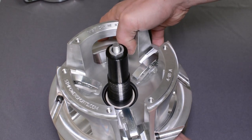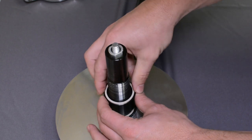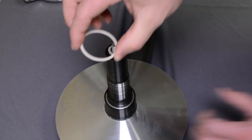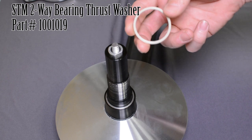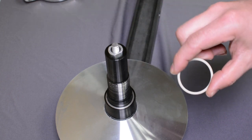You can pull the sheave off. If you need to replace the thrust washers, those are part number 1001019, sold each. There is also the bearing — two thrust washers in total, one on top of the bearing and one on the bottom.